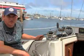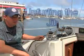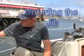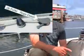You can ease out your mainsail with the traveler and the mainsheet. Rolling out the jib — the furling line is on the port side. Flip your rope clutch. Typically coming out of Monterey Harbor, you're going to be unfurling and sailing on a port tack, using the starboard jib sheet to unfurl.